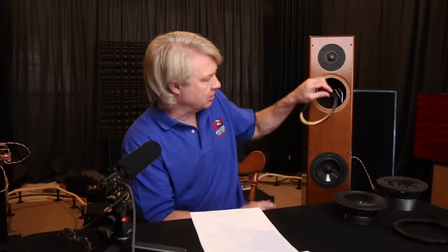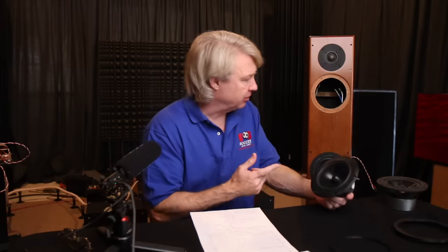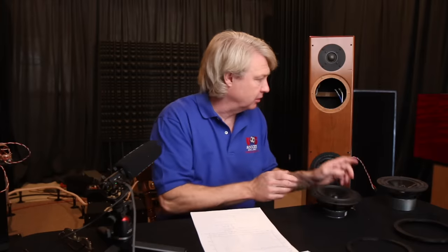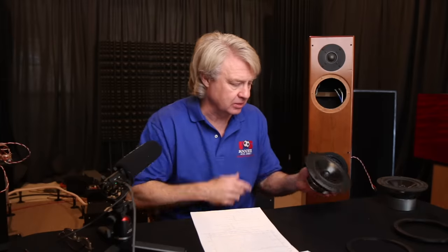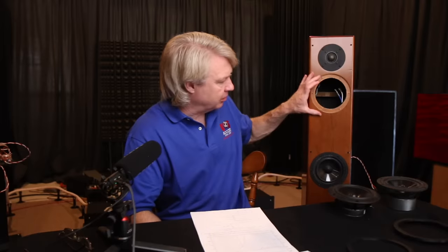So we came up with an idea to salvage this. Hobbs, who works for me, has a 3D printer and took measurements to design a little adapter ring that allows us to mount our M130 woofer in that hole — it needs about the same airspace and fits the hole after we drop in the adapter ring to fill the gap and give it a flush seat. Our M130 has a beautiful response curve that rolls off naturally and really smooth, and usually only needs a two-part second-order filter.